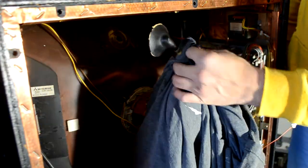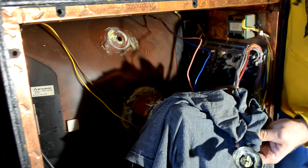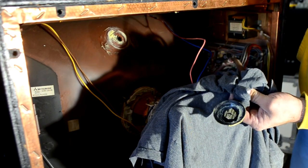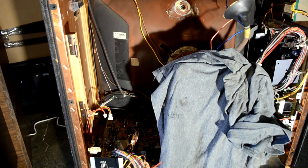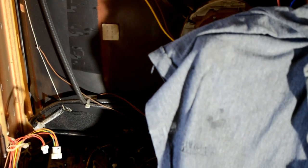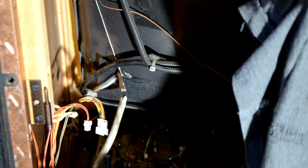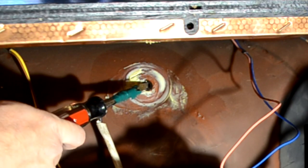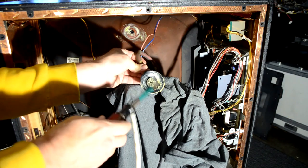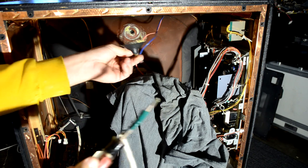Unintentionally I actually wiggled the cap off the back of the tube — it didn't appear to be making very good contact. It just came right off. So now I'm just going to get my discharge tool, hook that up, and discharge this point. We're going to zoom in to the back of the tube — look for the exposed metal band on that spring down there towards the corner. A little alligator clip first — we'll touch the tube... nothing... nothing... okay, and that's it.